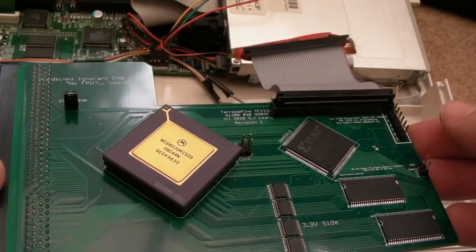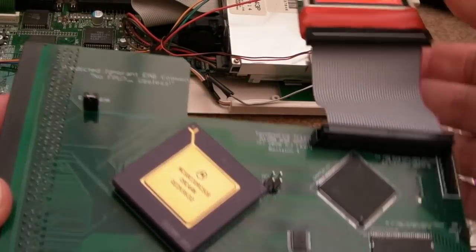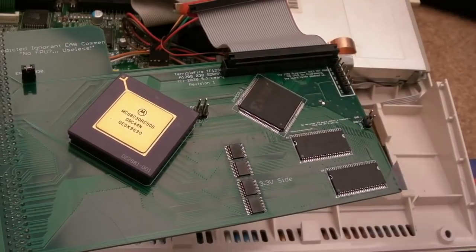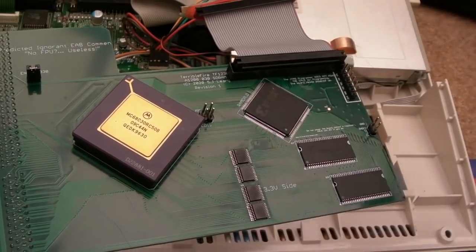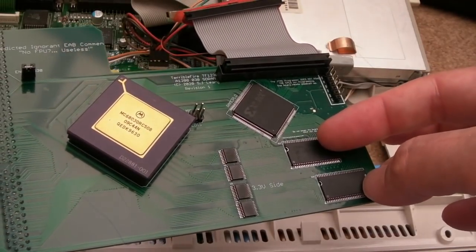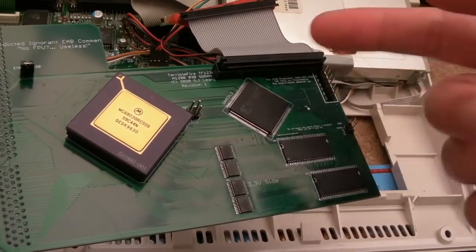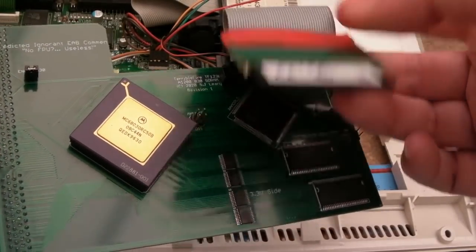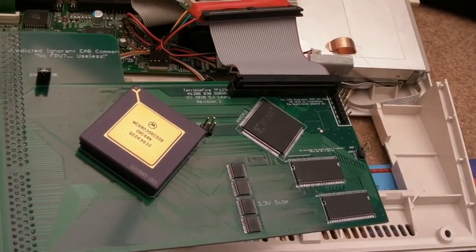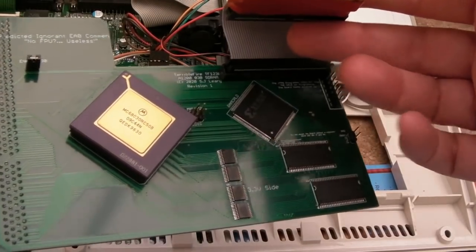You could argue it's a bit pointless, really, because 64 meg is a crazy amount of RAM and more than sufficient for everything on the Amiga, really. There are one or two exceptions. Beneath a Steel Sky, there's an awful lot of discs to that, a crazy amount, like 11 or 12 or 13 discs. If you load that into a device like this with 128 meg of RAM perhaps, you'll find it fills the majority of that RAM up. Now, I might be thinking of the CD version with FMV and everything, but that's the only sort of use case for something like that, unless you're going to use productivity software, things like Lightwave and do rendering and stuff like that, in which case you'd probably want to use a 4000 or something really for something like that.